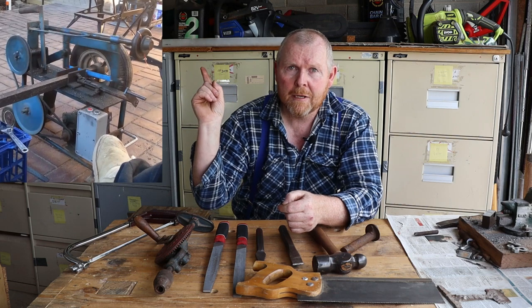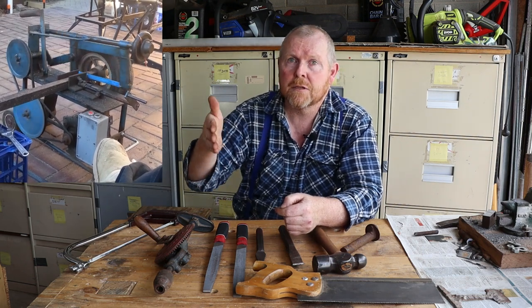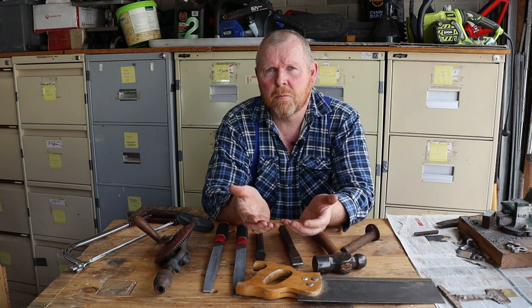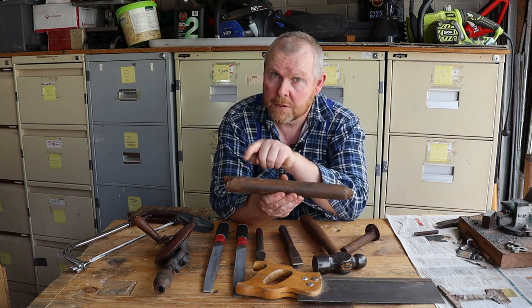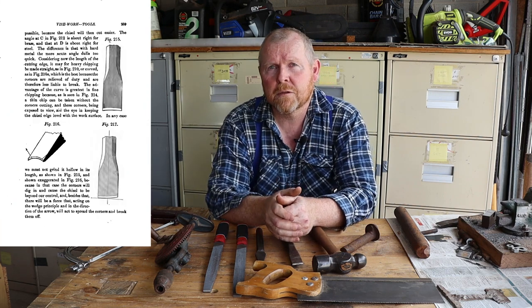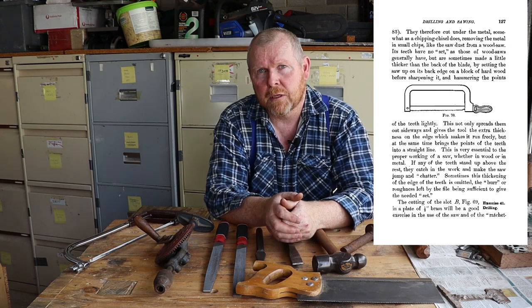It seems like the Clemson Brothers were scientists as well as engineers, because one of the first tools that they made to assist with their experiments in making hacksaw blades was an automatic hacksawing machine. The big benefit of a machine like this is that every stroke is exactly the same as the last one, and also your arm's not going to get anywhere near as tired. Between 1884 and 1886 they experimented with literally dozens of different tooth forms and levels of hardening until they finally came up with a blade that could cut over 350 slices from an iron bar without going blunt. Once the Clemsons brought it to market it didn't take long for hacksaws to become popular. This 1885 textbook has over 12 pages of details about cutting metal with chisels but doesn't mention hacksaws at all, whereas this 1890 textbook shows a fairly modern looking hacksaw and even mentions automatic power driven hacksaws being relatively common in factories by then.